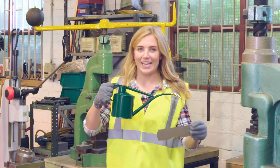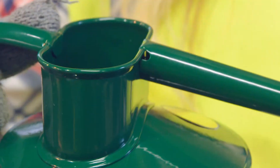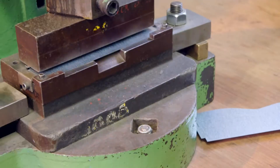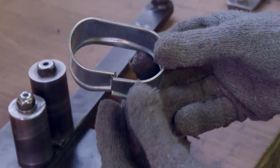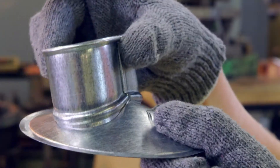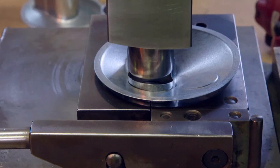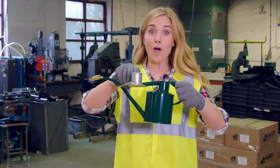What part of the watering can do you think the mask-shaped piece is going to make? The top part is called the neck. First the metal is pressed and bends around two blocks into an oval shape. The oval-shaped piece fits into the oval-shaped hole, but it's still loose. So a hand press presses the two pieces together. Now we've got the top part of our watering can.